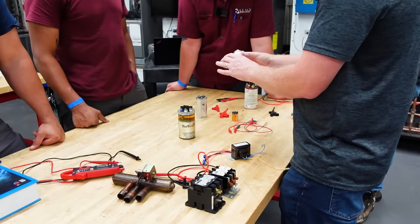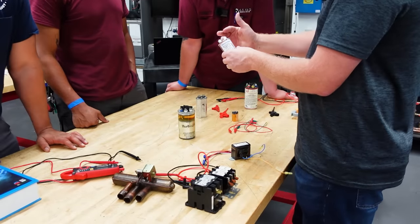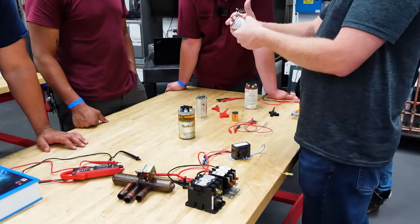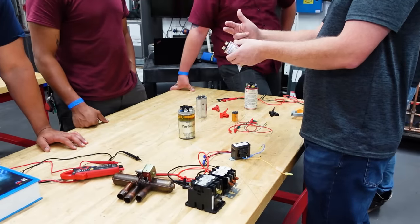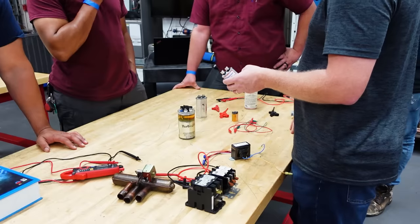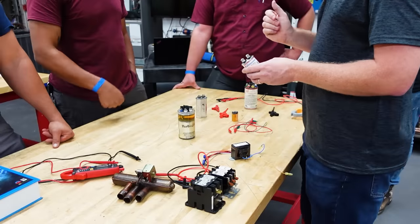A lot of people assume that somehow it's boosting up the voltage. It's not. When you measure a higher voltage across that capacitor, what are you actually measuring? Have you ever done this where you go across a capacitor when the system's running and you measure the voltage? Yeah, it's still like 300 or something. It's higher. It's not always a set thing, but it's always higher. Do you know why it's higher? Back feeding voltage, because the motor's a generator. Because the motor's acting as a generator.